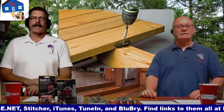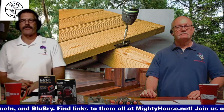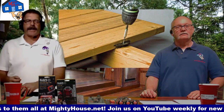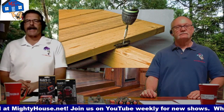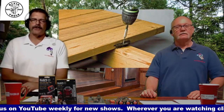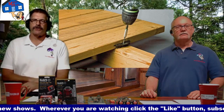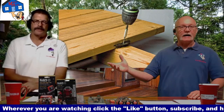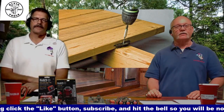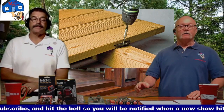The screw technology has gotten crazy. People keep buying drywall screws for everything, but there are exterior screws that are self-drilling and self-countersinking — great options, though they do get costly. With Ipe you've got to pre-drill and counter-sink everything. Always use stainless steel screws or hot double-dip. They need to be ACQ-safe — able to work with pressure-treated lumber and framing — otherwise they'll rot out within a year and all your decking will be loose and flopping.